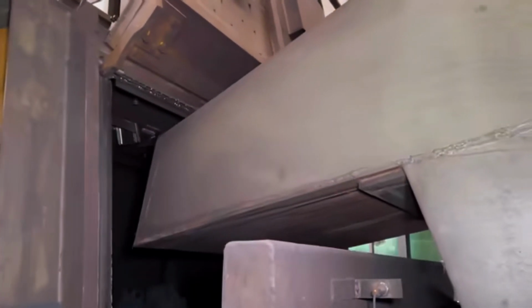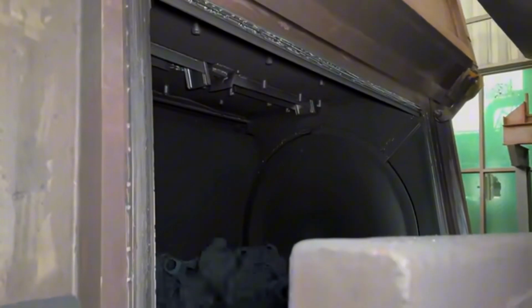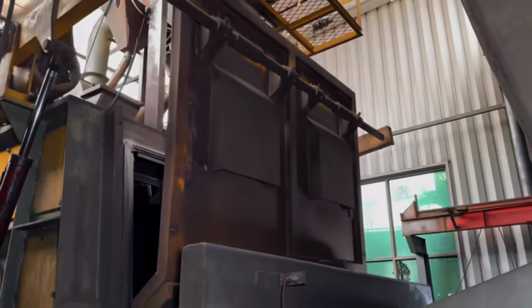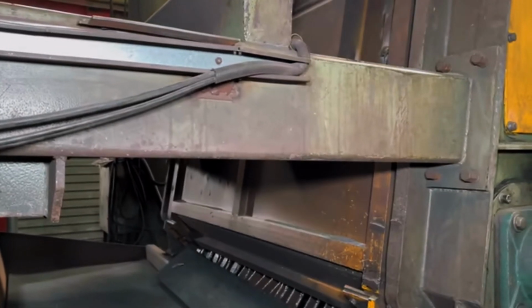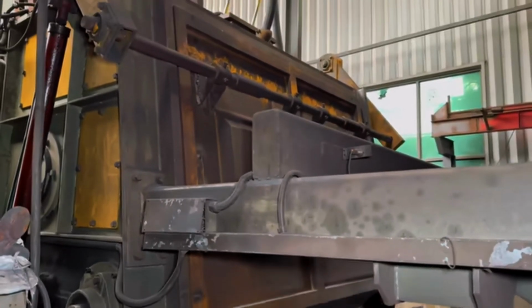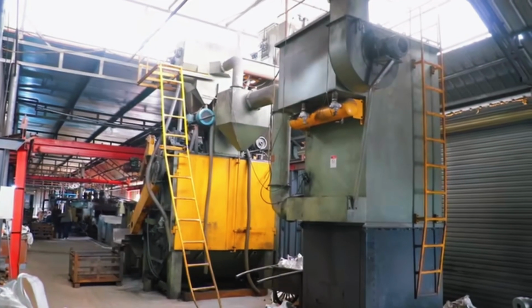Once the axle is heat treated, it moves on to high precision grinding. This stage polishes key surfaces to ensure perfect fits at the contact points: bearings, gears, retainers, and suspension components. A surface treatment is then applied, such as bluing, phosphate coating, galvanizing, or anti-corrosion coating, depending on the type of vehicle and the environment in which the axle will operate. This ensures that the part resists moisture, dirt, salt, and other external factors that could deteriorate it over time.